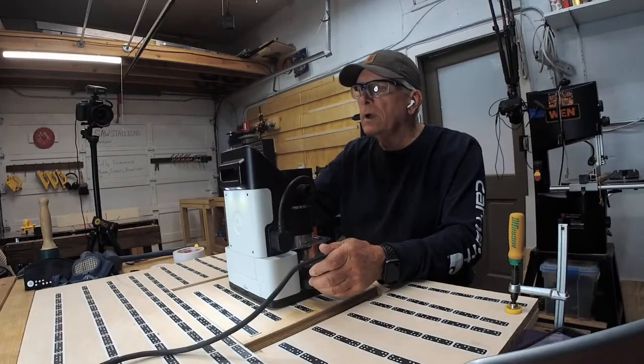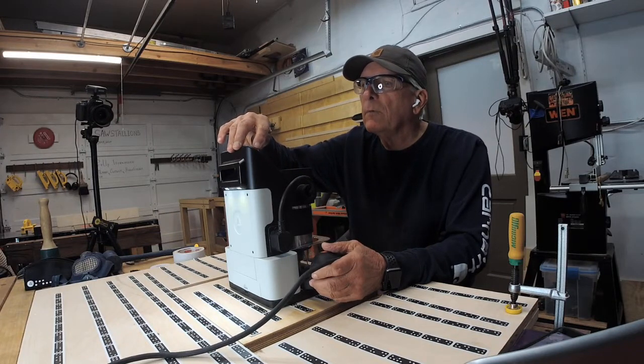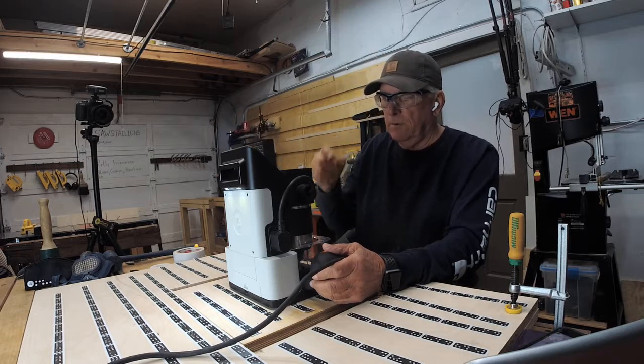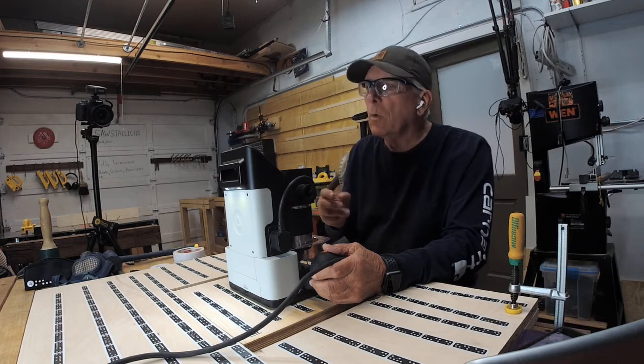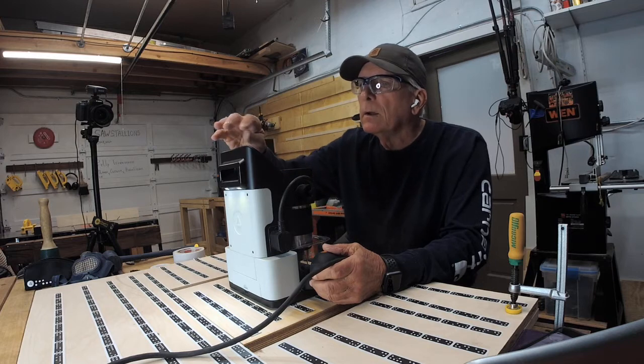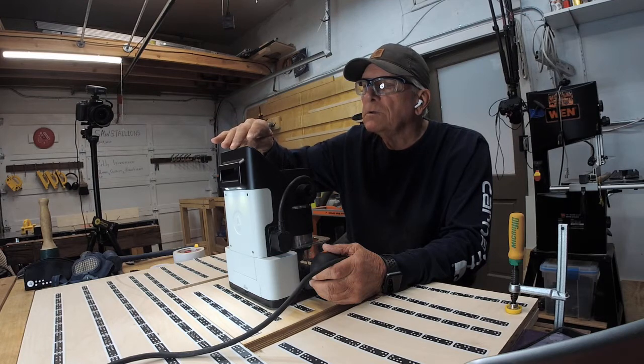Next thing I'm going to do is cut. And in this case, I have to tell it the depth at which I want to cut. So I'm going to cut 1/8 just for the demo here. There are engraver bits, there's a 1/8 bit and 1/4 upcut bits. And I'm sure there are different kinds of bits depending on different jobs, just like there would be for a CNC machine.